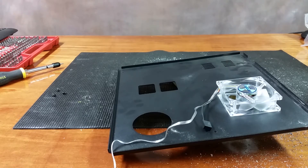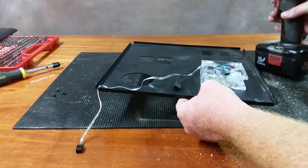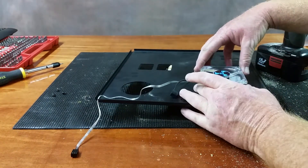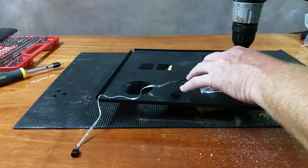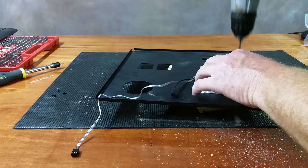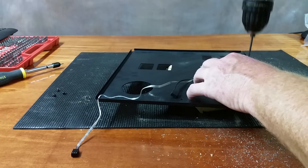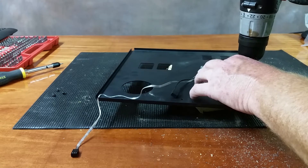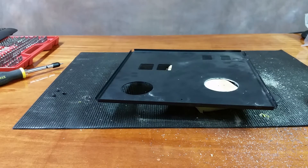Let me figure out what size drill bit I will need — that's a three sixteenths bit. I don't have a metric set to work with, so I will use it. What I think I will do is actually take a smaller bit and just scratch the paint so I'll know where the holes will go. Let me just do a quick eyeball of this thing, kind of get it in the right position. That scratch slip made enough where I can see where to drill, so I'll go ahead and get these drilled real quick.